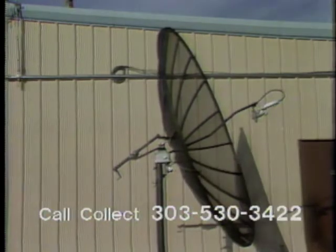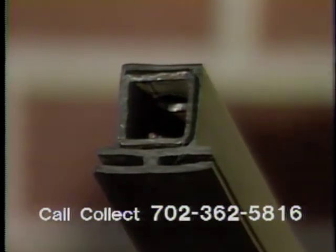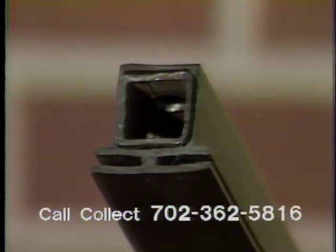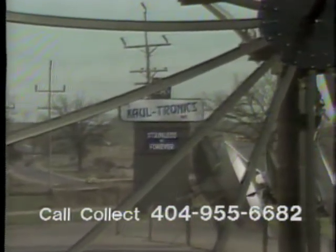The extra strength hub is parabolically formed to maximize signal strength. Like the keystone of a great building, the hub is engineered of 3/16" prime steel and measures a solid 14.5 inches in diameter. The ribs are made of superior strength tubular 16-gauge steel encased in polytrans vinyl, especially formulated for the satellite industry. The end result? Solid strength, at the same time minimizing the size of the ribbing. This avoids the bulky appearance of so many mesh antennas.